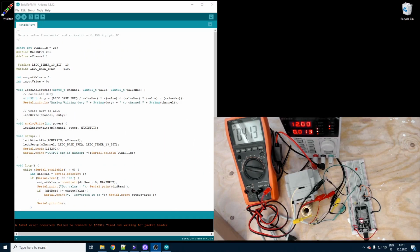This is test number 4. Now I'm using an ESP32 microcontroller to control a proportional valve. The proportional valve has a working voltage of 12V and the control voltage should be from 0 to 5 volts, where 0 is fully closed and 5V is fully open.